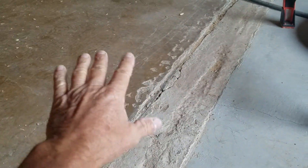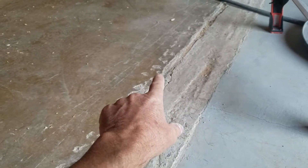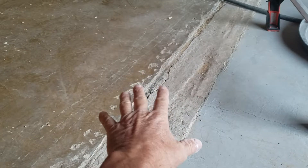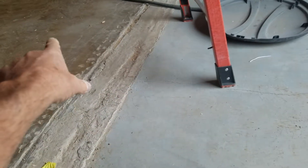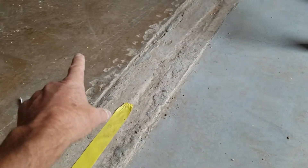So I'm going to suggest a combination of things. First, grinding to a better profile to begin with. The aggregate inside this slab is 90 to 130,000 psi — it's going to take a long time to grind it even with our very aggressive diamonds. So a combination of grind and then stitching this slab into the footing.